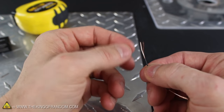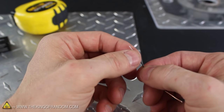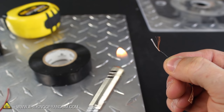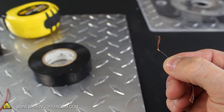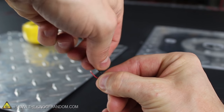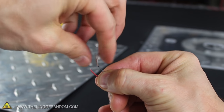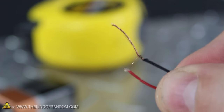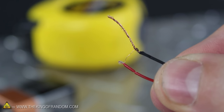Now let's take a close look at the other wire. If it has nylon cording mixed in with the copper strands, you need to get rid of it. The most effective way to eliminate it is to lick it with a flame from a candle or a barbecue igniter. Now hold the two cables side by side about a quarter of an inch apart, then twist the bridge wire from the first cable so it binds together tightly and meshes in with the other strands. This will ensure the bridge wire has great electrical contact and should prevent it from unraveling.